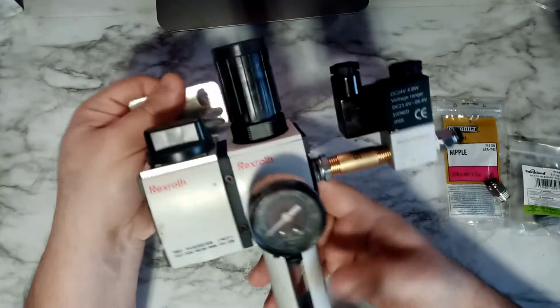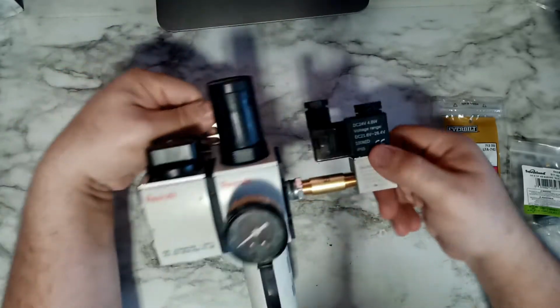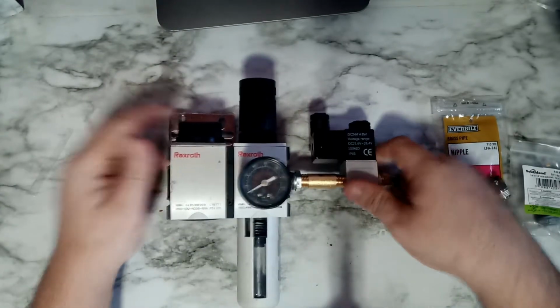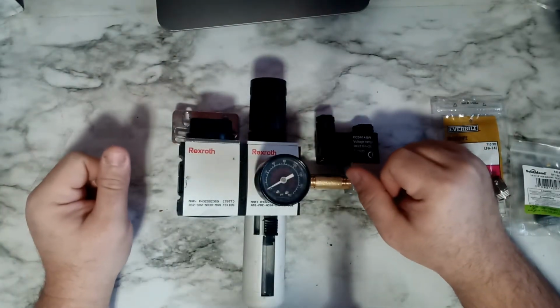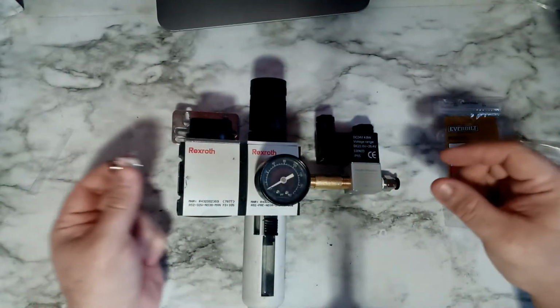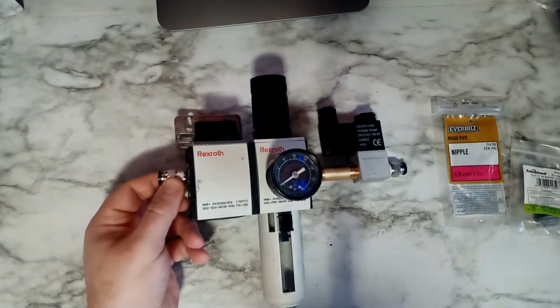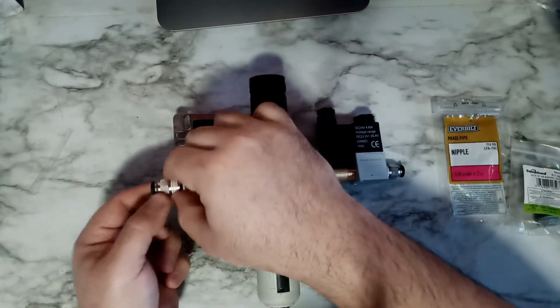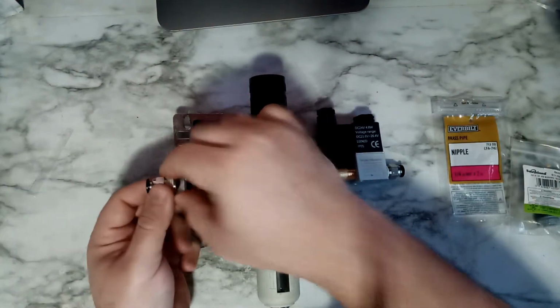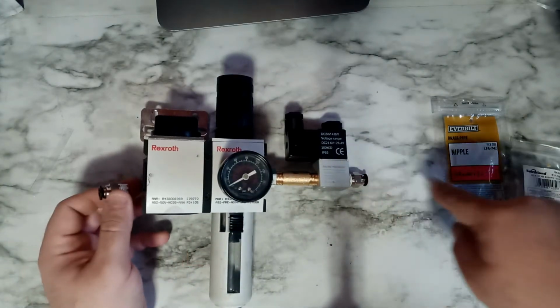That's why I'm using this guy, because I have a nice bracket that I'm going to mount it to anywhere, and nothing's going to move anymore. Okay, so let me put those together, and of course one of these is going to go in here, and one is out. So on a small air hose, the black one I showed you earlier, is going to go to the compressor. Then from the compressor, from this guy, it is going to go back to the laser.